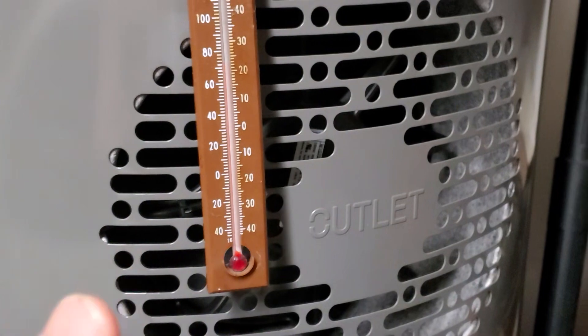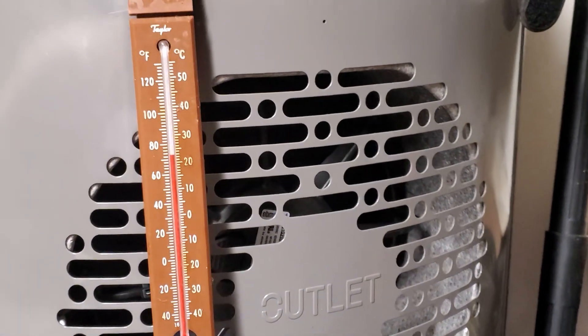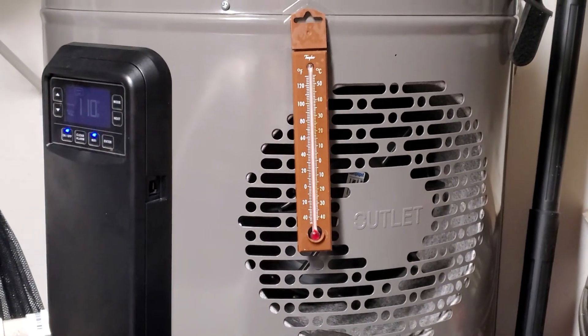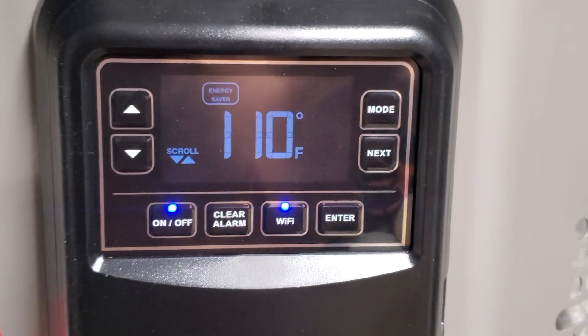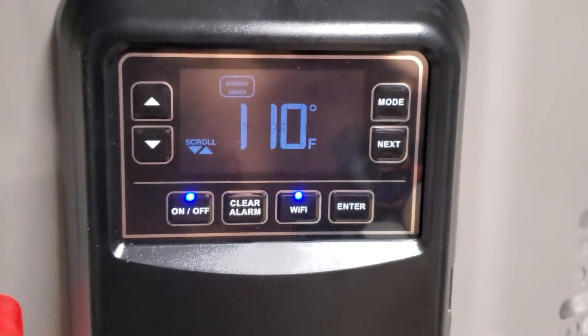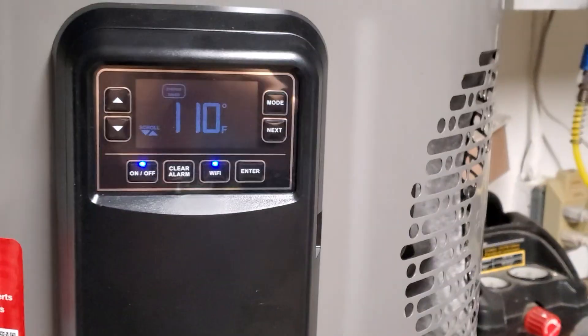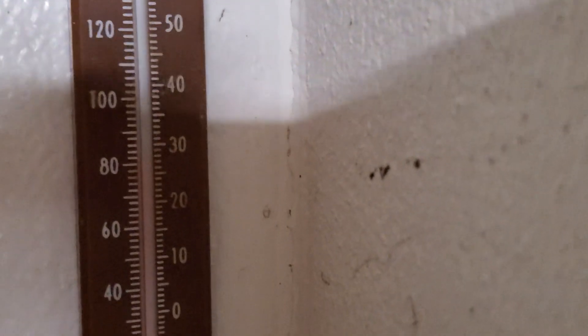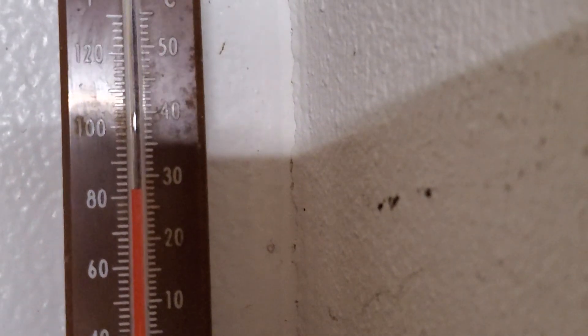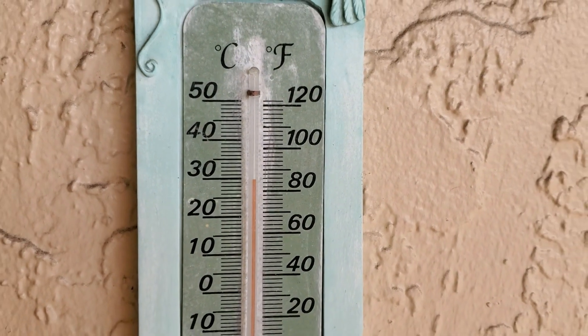Air is coming out of this outlet, so it will probably cool down my garage a little bit, but don't expect your garage to be livable. After about 10-15 minutes of working on energy saver mode, my water heater has reached 110 degrees, the compressor has shut off, and I'm reading about 82 degrees in the garage — so my garage temperature is much lower than it is outside.